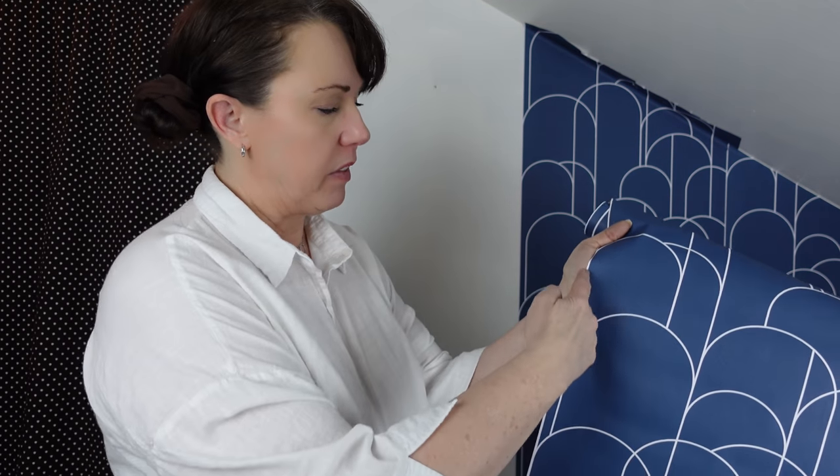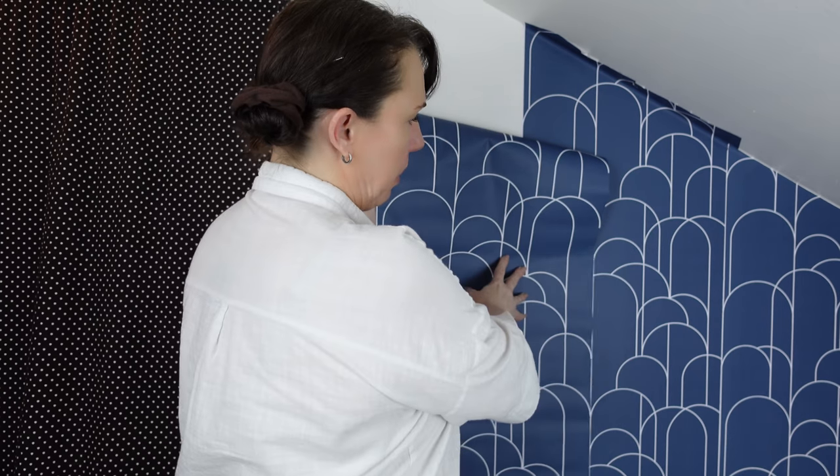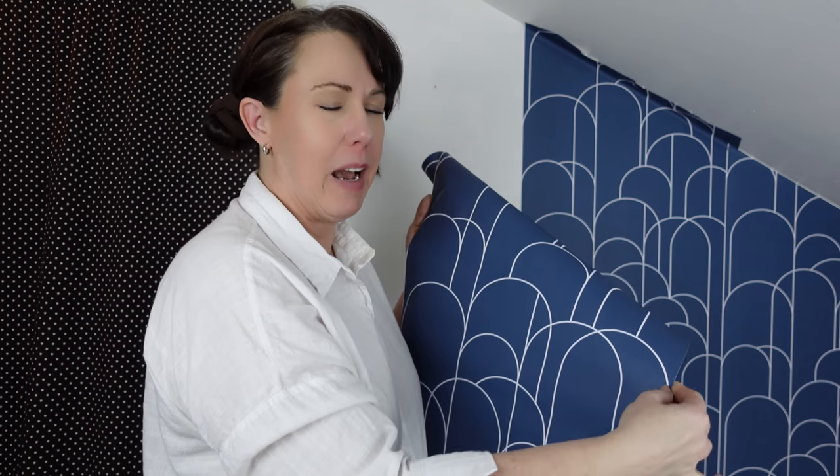I wanted to show you how I almost messed up — well, kind of messed up. This particular paper, on the left-hand side there's a white line, and on the right-hand side the arches just kind of dead end. They're supposed to go up from left to right. I should have hung the first piece on the left and then had the next piece barely hang over, so you don't see these breaks. What I had to do, because I started in that corner, was lift up the paper just the tiniest bit and slide the next piece under it so that the white line is there. It's really clunky. I'm only showing you because I don't want you to make the same mistake. There was no indication on the package that this was supposed to be hung from left to right, although that's kind of industry standard. So if the paper doesn't say otherwise, please start on the left-hand side and save yourself a whole lot of trouble.